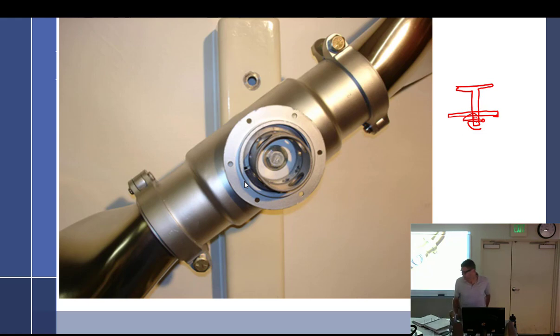There's a lot of stress on props — vibration is a concern. If you have vibration, you probably won't have an index problem on a spline shaft since there's a dead spline and it can only go on one way. It could be out of tracking, meaning a blade is bent. Or it could be improperly balanced — it just needs a balance.